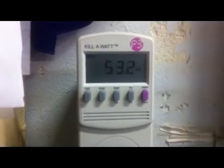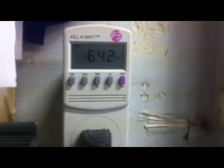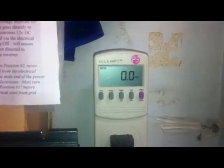We'll see this cranking up here in a second. These are just the watts being dumped because my charge controller is in divert mode. It just went off divert mode, so now those watts are going into the battery, charging my battery bank. I've got about six deep-cycle batteries, 232 amp-hours apiece. So here we go again in dump mode — it's dumping into the plug-in and there's our watts, you saw 180 there. Before I had this rewired, when it dumped it was actually dumping not only the incoming power from the wind generator but also off my battery. So I rewired that so now when it goes into dump mode it's just dumping into the plug-in grid-tie inverter the watts from the wind turbine and nothing more.